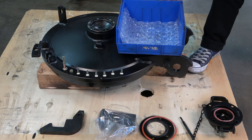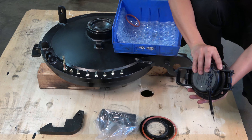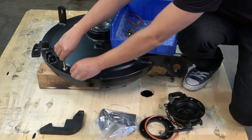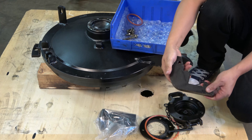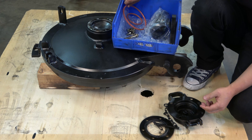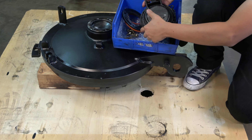The disassembly process is now complete. The disassembled parts should include a small o-ring, ten 5/16-18 by 7/8 inch hex drive flat head screws, a single 3/8 inch by 3-inch bolt and 3/8 inch nylock nut, the safety hook, the threaded ram, the larger o-ring, the ram retainer, and the locking cap assembly. Store all parts together with the strongback and lift assist spring.